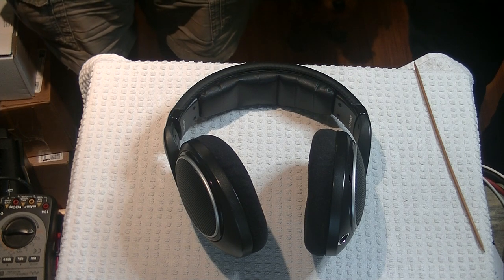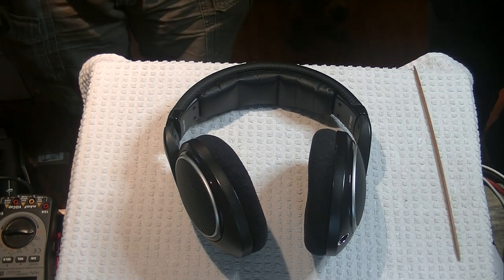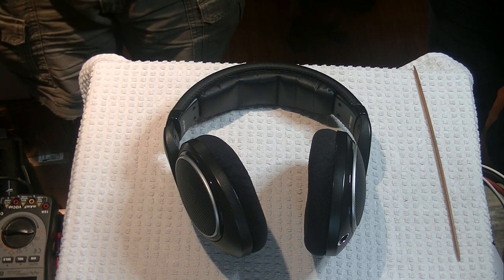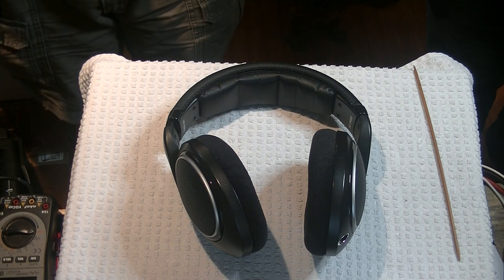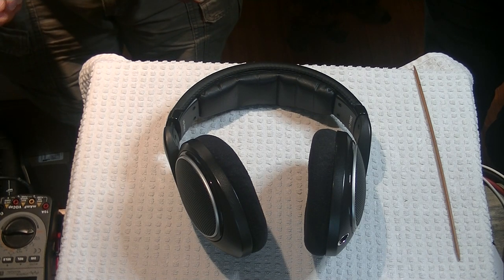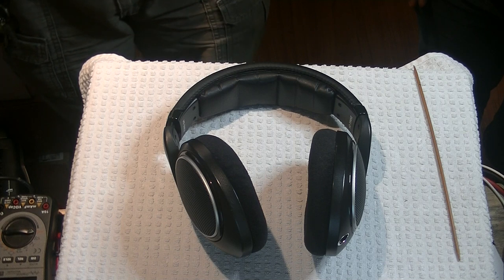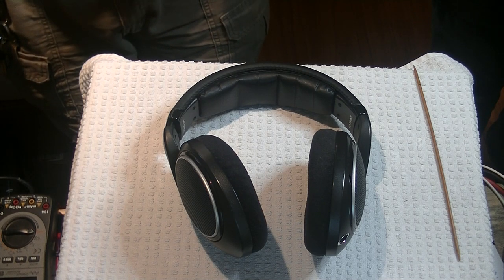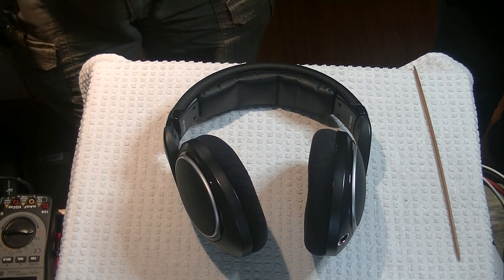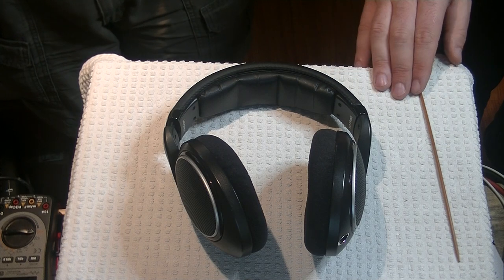We want to make sure it's going to sound good on modern, high-quality headphones. Quality is a must. The big thing we're stuck with is a lot of headphones — even expensive ones — don't have a flat EQ. That's going to be one of the key decisions. We need headphones that sound good, that people want to actually use in their system, but the response has to be flat. Headphones are notorious for not being flat; we don't want them coloring the sound if we can avoid it. If you choose headphones with some bass boost and treble boost, that's the sound you like and that's fine, but we need the actual amplifier to produce a flat signal. We need proper headphones to test that with.